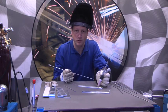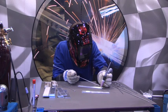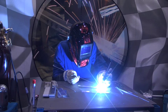This hand is doing most of the movement. First we're going to establish our puddle, increasing our current control until the puddle is established. We're going to start adding filler metal to the edge of the puddle, then start moving — dab, move, dab the filler, move, dab the filler — and as you master that move and dab technique, you can start picking up your rhythm. Pretty soon you'll be just moving and dabbing in one motion.